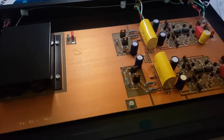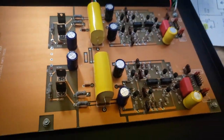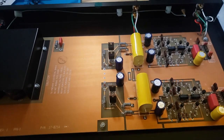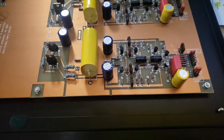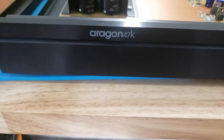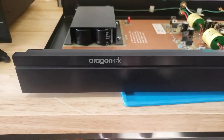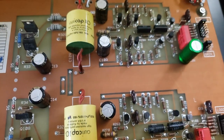I think that's it — I think we've spent enough time on this. If you're looking for a nice phono stage and don't want to spend two, three, four, or five thousand dollars on a high-end phono stage, you could really enjoy getting one of these Aragon 47Ks, getting the IPS power supply for it, doing a simple recap, and maybe a couple of resistor and cap upgrades — and you'll have a really nice sounding unit.